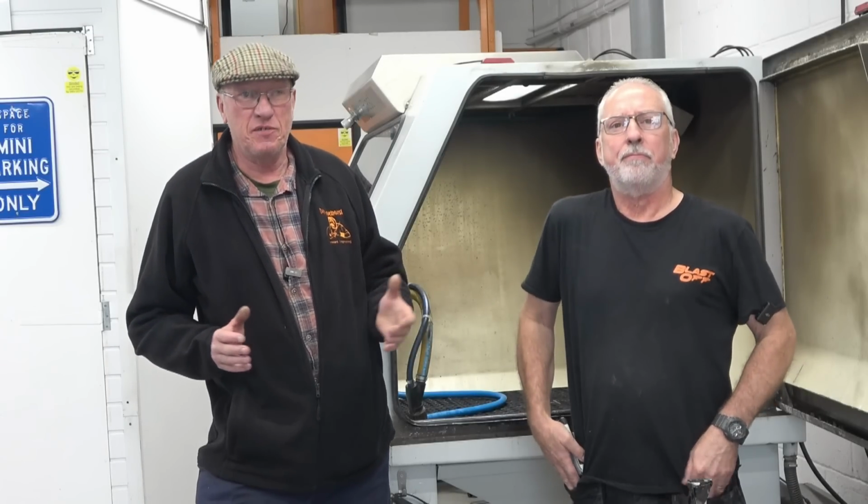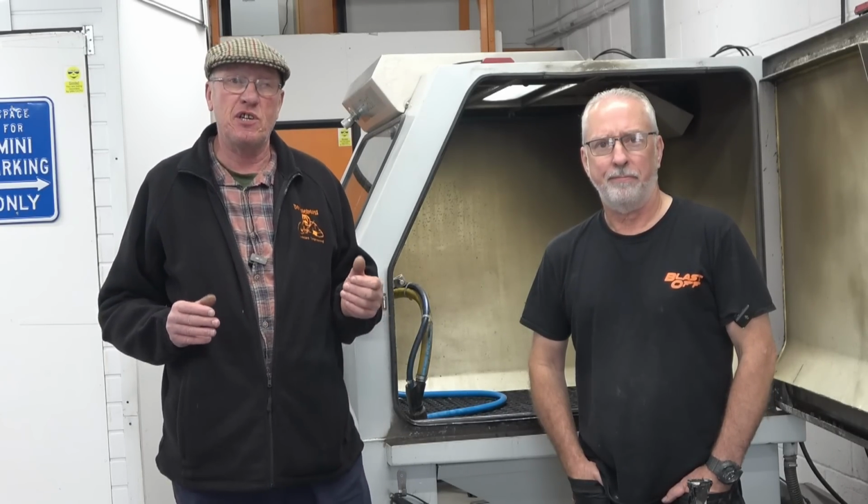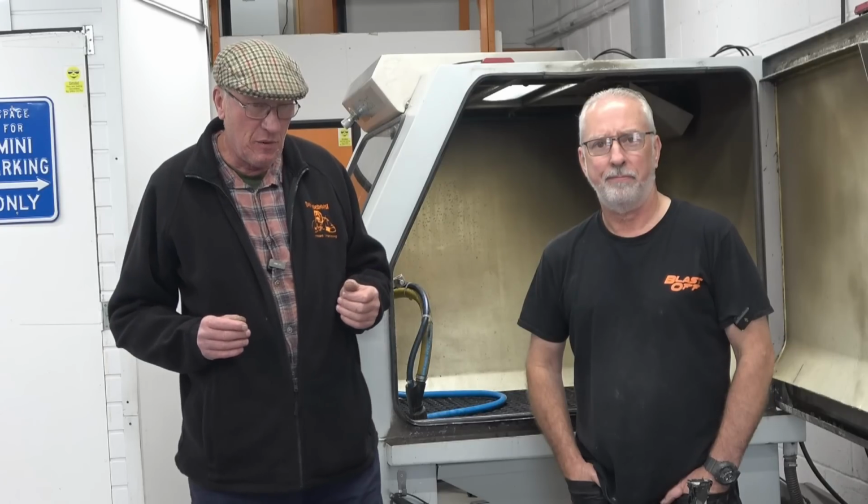After stripping this vintage steam engine, I realised that the clean-up job is just too much for me. I have in the past had stuff sandblasted, well, bead blasted, and I wasn't very impressed with the result. It actually damaged the machined faces. Now, a friend of mine uses this company called Northeast Blast Off, and they do vapour blasting.